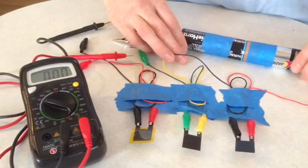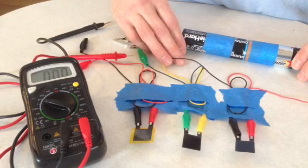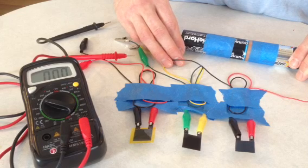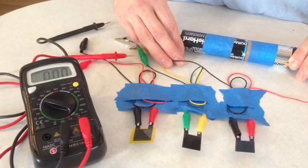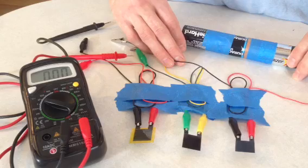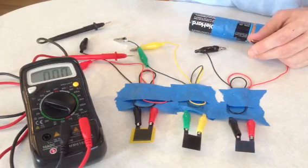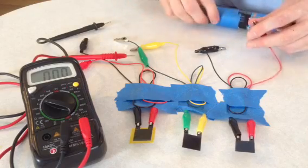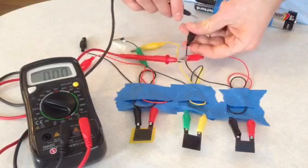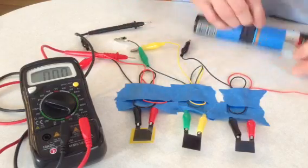The polyvinyl acetate and the polyvinyl alcohol, from what I measured, were pretty much the same. I think that Elmer's glue is definitely a viable option for the solid-state capacitor. I didn't use any Kapton Tape on either of the solid-state ones. Both of these did not take as long as five hours to dry or overnight. I was testing them last night as well and getting the same readings — actually higher. I was getting much higher readings last night on both the solid-state ones.